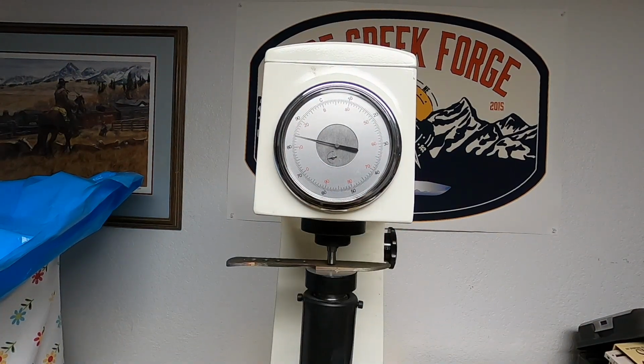But these softer readings here, I'm attributing more to things like the surface finish. And you know, if we had wild problems with the heat treat, we wouldn't be getting a 62 reading on here. And if there was a minor breach in our foil, then there's probably some minor decarb, things like that, without actually grinding off the surface and really paying attention to that. Then so now we're up to 63 here.